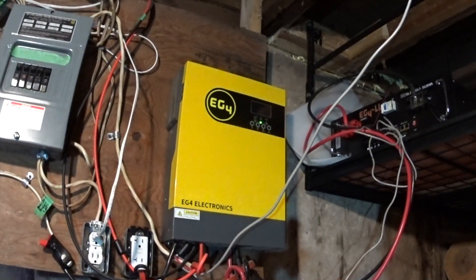With 15 kilowatts of battery storage, I should have a place to consume all that those 3,000 watt panels provide and save even more money on my electrical bill. The payoff period — because this is not grid-tied and I don't have a net metering agreement — is probably 10 to 15 years. Whereas with a grid tie, the payback is probably 6 to 7 years.